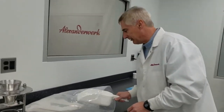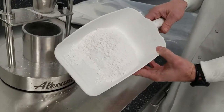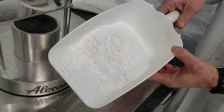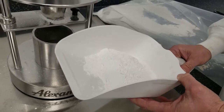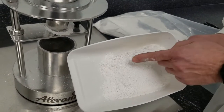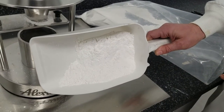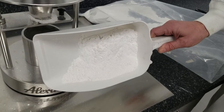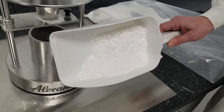So what I have here is a shovel full of material. As you can see, this material is very fine in size — it averages about maybe 100 to 200 microns in size roughly, kind of looks like ground flour almost. It just does not want to flow whatsoever. You can see it has a very high angle of repose when I start tilting the shovel; the material almost has an angle of repose of about 80 to 85 degrees, indicating it just does not want to flow.